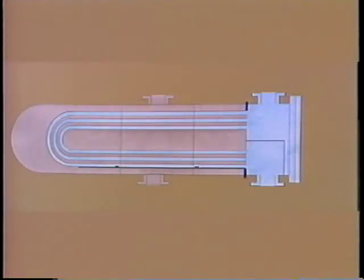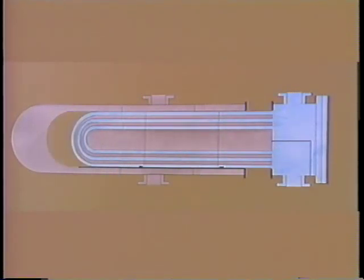The basic job is not much different on a large shell-and-tube heat exchanger. In the case of this large heater, shooting the tubes was done with high-pressure water and compressed air, which was sufficient to remove the small amounts of scale in the tubing. Although the tools are pretty much the same as those used on the condenser, one thing to consider with a U-tube heat exchanger is what you shoot the tubes with — longer bullets or brushes can get hung up in the bend in the tubes. When the outsides of the tubes need cleaning, it's necessary to pull the tube bundle out of the heater. Tracks and rollers inside the shell allow the bundle to be pulled out, and once exposed you can wire brush scale away. In oil heaters, solvents made for that purpose can be used to remove oil from the tubes.